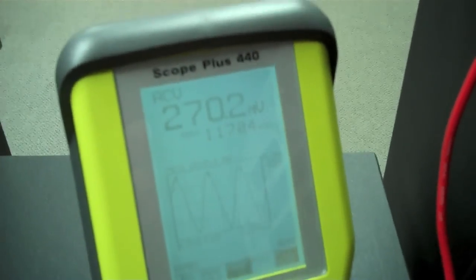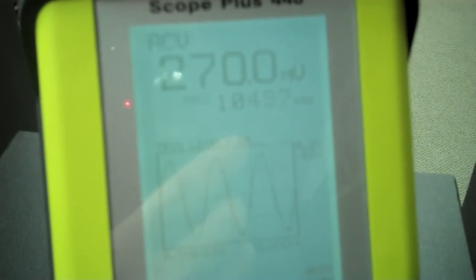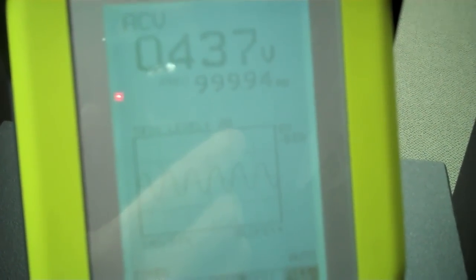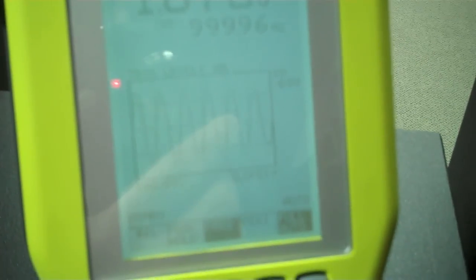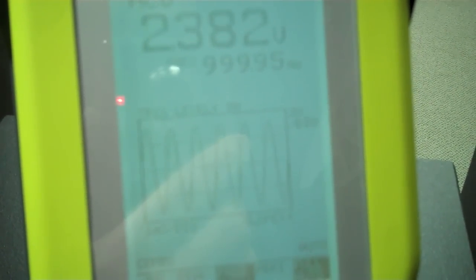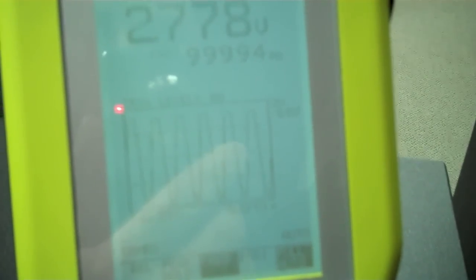You'll see it's kind of loading up right now. Let me turn it so there's less glare. You'll see there's a graph that came up there. At the top you'll see some numbers. The top number is the actual voltage that it's putting out; the second number is the frequency. So what this is, is a one kilohertz — 1000 Hertz — test tone. What we'll do is turn this up. I'm turning the volume up on the radio right now. I'll turn that up until we see the graph start to look a little choppy, which it does right now. You'll see the tops of it are skewed — they're chopped off. That means that there's clipping present on the signal.